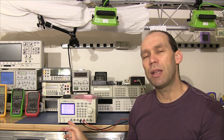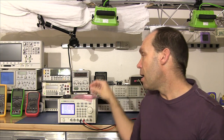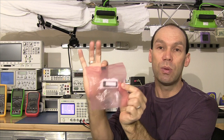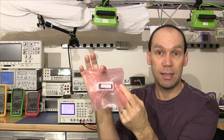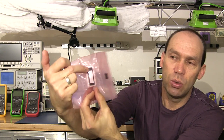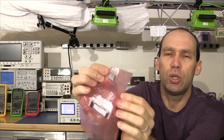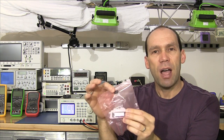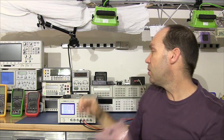So what I'm going to do is demonstrate that error again quickly, then we're going to open it up and have a look inside. But the main goal is that Paolo has sent me two EPROMs with updated firmware. The factory is actually going to redo their firmware and update their IC packages. One is a standard dual inline package EPROM, and the other is a small 32 PLCC package. This is a 512k what they call super flash EPROM.